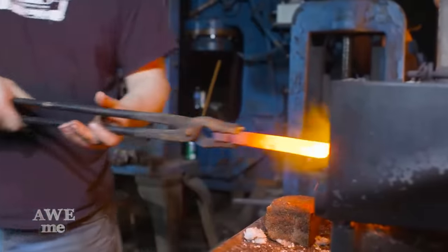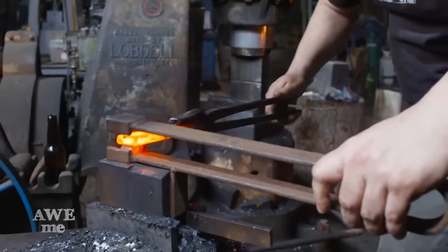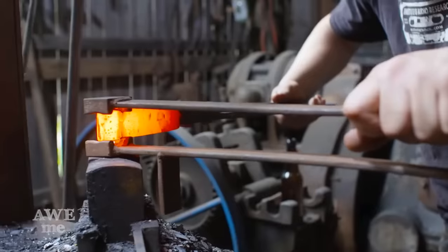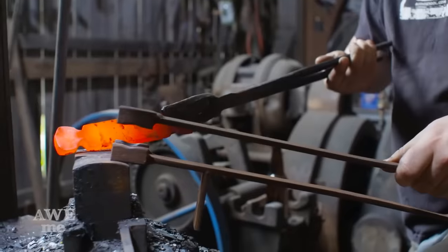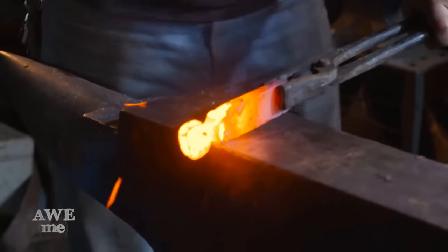The blade now to shape and the tang defined, Sam now knows his proportions for the guard. He's going to use the excess 1045 that he cut off from the blade forging and forge that into his guard. He starts by using a tool under the power hammer to pinch some material. He'll then draw that out by hand and then forge the round ends that we need.